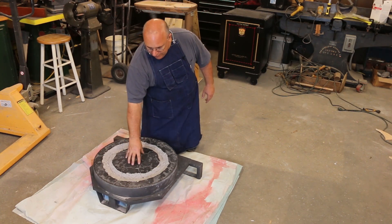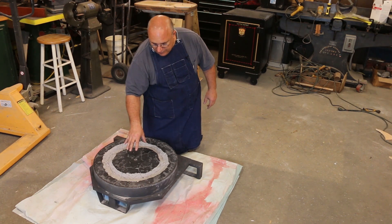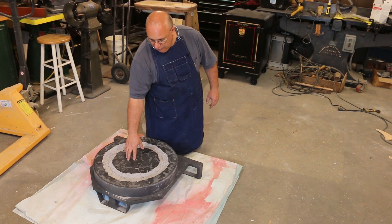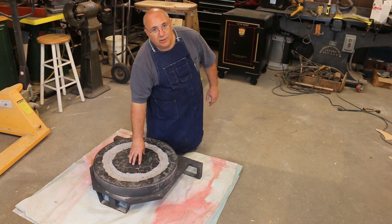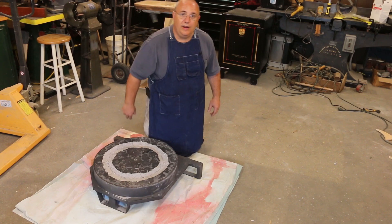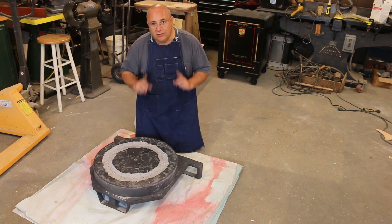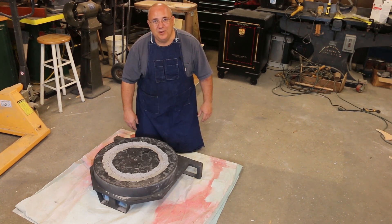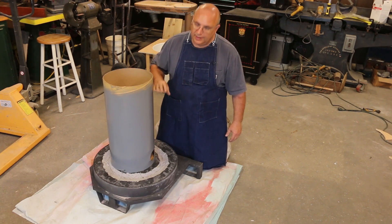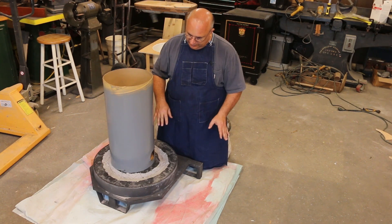In use, there will be a block right in the center — a plinth — that the crucible will sit up on, and that'll cover the hole. So under normal operations it will be covered up, but if something were to bust in there, we could move that out of the way and drain the metal out the bottom without a big mess. So now let's go ahead and get started building up the forms. We're going to start by positioning the center form tube, and there are a couple of things I want to show you that we've done to get it ready.